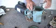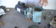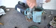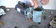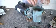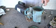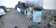The next thing I like to do, the top of these lids take a lot of abuse, just from scale and the O-rings and everything else. When I do these pumps, I like to take off these T-bolts first. A lot of times these T-bolts need lubricating and greasing also. They just squeak, they're hard to turn, or sometimes you have to take a wire brush and keep turning them back and forth and lube them just to get them off.